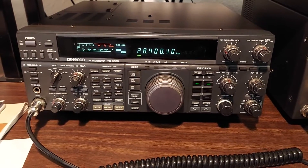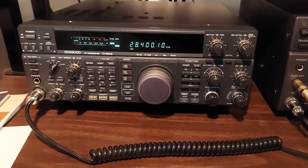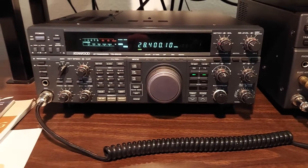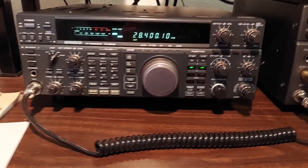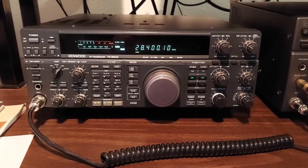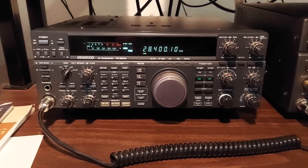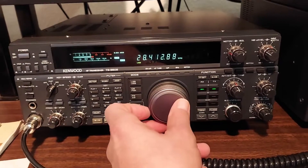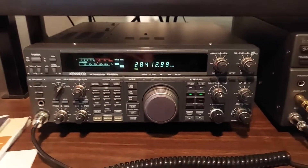I've got a contest going on this weekend so I've been mostly monitoring, haven't really participated. Anyway, short video, but for such an old radio these transceivers are pretty decent. There is a mode where you can select the transmit width on your filters — this radio was kind of popular with the hi-fi SSB crowd back in the day. You can go into the menu and set your transmit filter to 6 kHz, or even open it all the way to 12 kHz, which gives you double sideband, using up a lot of spectrum, but it's a nice radio. I've had a lot of fun with it.